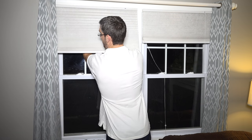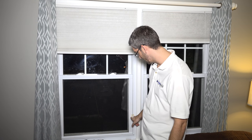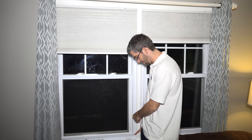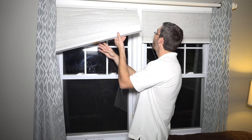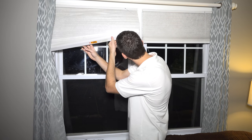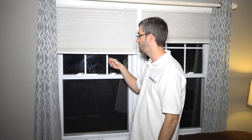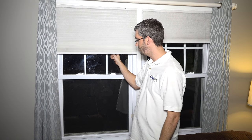When they open in both ways, a lot of people assume that they need a sensor down at the bottom. You can see that this old wired system had a contact down at the bottom, and looking at the top, they didn't even protect the top. So all someone had to do, if this window was left unlocked, was put some pressure on the window, slide it down, and they could climb right into this room and no one would ever know.